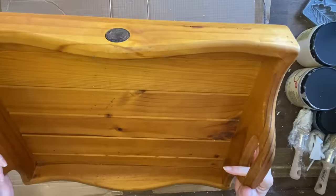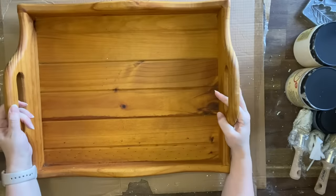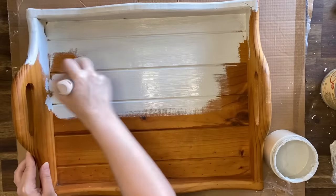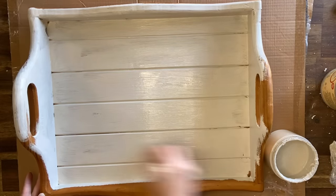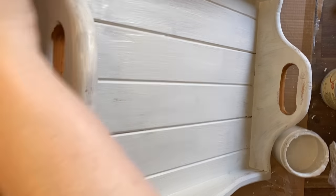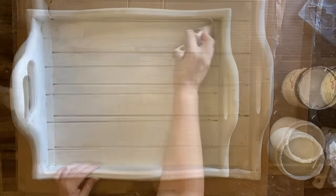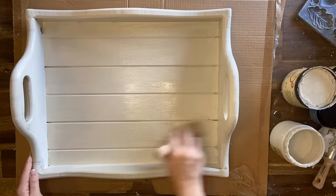Our last project is this really solid Australian-made tray that I found at the thrift store. It was pretty plain, so after cleaning it, I'm going to give it two coats of Dixie Belle's Sawmill Gravy, painting the entire thing including inside the handles. This was not a shiny surface, so I'm not worried about paint adhering — chalk paint has great adhesion, so I haven't worried about any primers. This paint has really great coverage. On the inside base of the tray, I decided I wanted to add some decoupage paper, so I'm going to be using the beautiful sheep Recycled Treasures design. I really love these two little sheep — it's in landscape, so I'm just lining it up and working out if it's going to be the correct size.